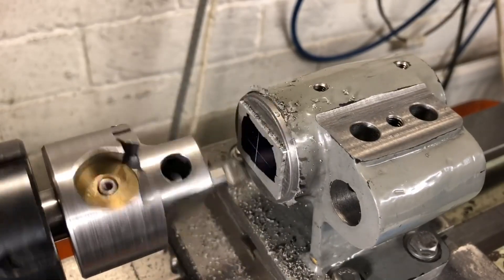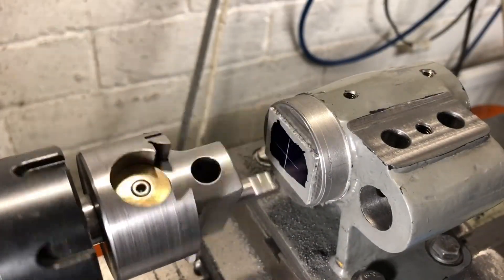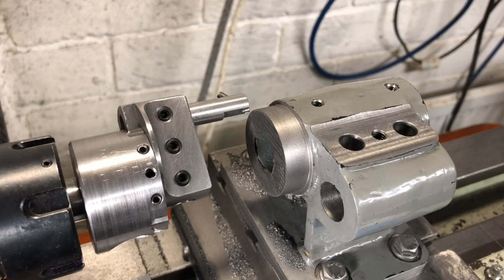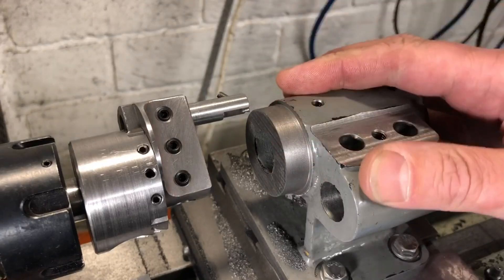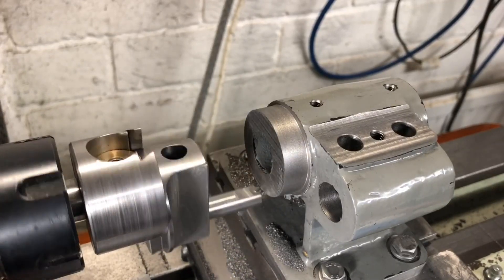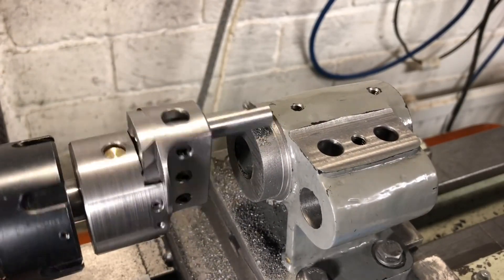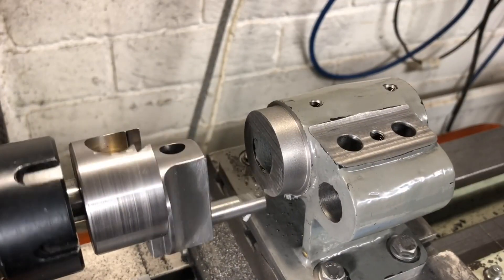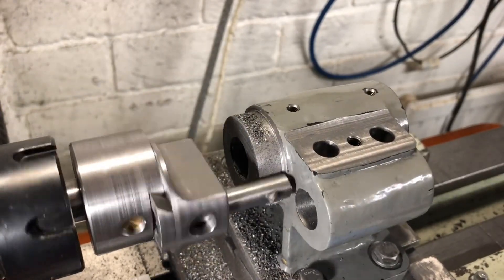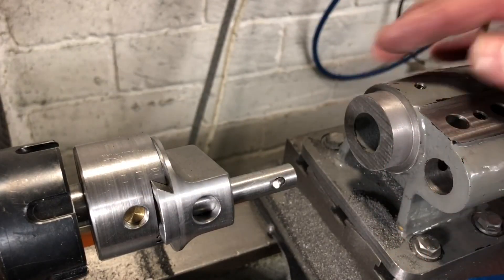Alright, it's still not lovely, but it is doing it. I have a carriage stop set on the bed to limit the depth, and I will play around with the feeds and speeds to find a setting that gives an acceptable finish — hopefully before I run out of material to remove. After trying more things than I care to admit, I have found some settings that create a not too terrible finish. We are in back gear, running at about 20 rpm with a feed of 2 thou per revolution, and I am removing about 25 thou from diameter per pass. It is slow going. After a considerable amount of time — what has been mere seconds for you has been an hour and a half for me — I have eventually got this to size. Having looked at this again, I think I might have been better off mounting this on a faceplate or a mandrel and turning this feature in about 5 minutes. Still, it's done now.